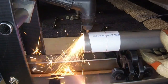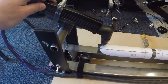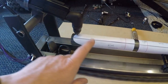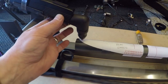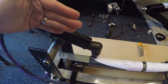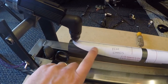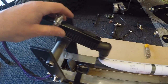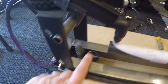My plasma cutter is on a little pivot right here. The important part about this pivot is number one that it allows the head to move a little bit, because as you're cutting and rotating the piece it will move slightly, so your torch needs to be able to go up and down with that. It also needs to be very strong so that if the tip of the plasma torch catches on your paper templates, this pivot will hold it pretty solid — and this one does.